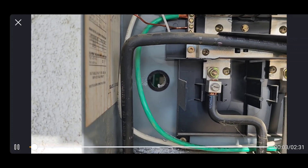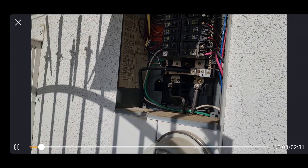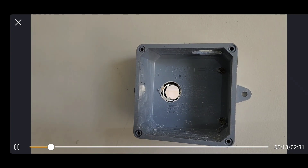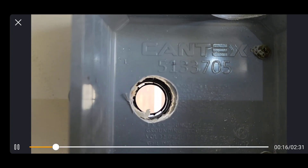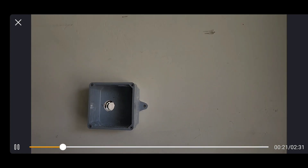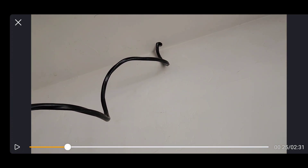On the other side of that I put a box — a plastic box, basically like a pull box — so I can make a turn, because that number six wire is really thick. I'm going to go straight up with a piece of conduit. I think that's like a four by four box. I have a 50-foot reel of six gauge wire — three conductors with a bare ground, so two hots, one neutral, and the ground, all size six.